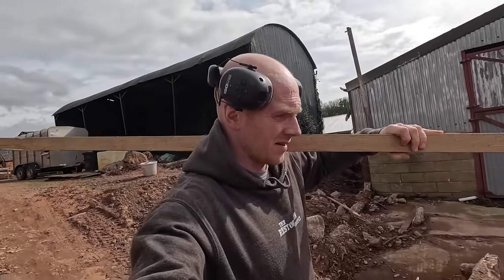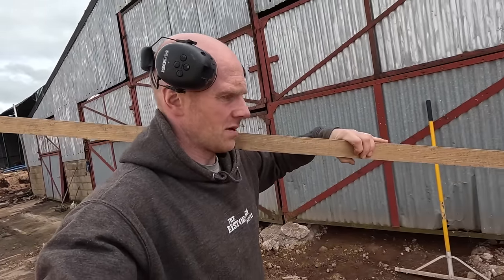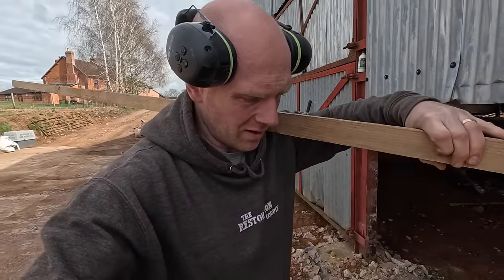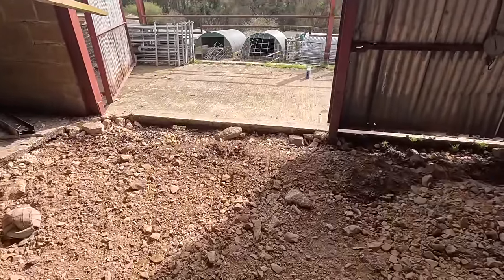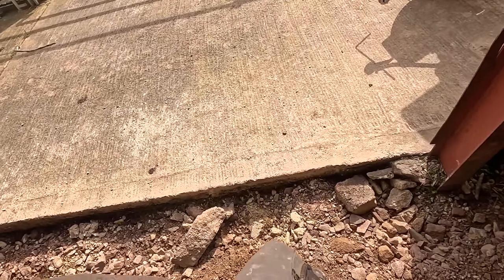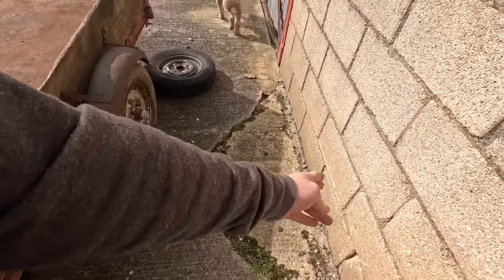The sun's out, so I'm going to go down to the far end and see if we can cut the same as we did up here — cut through the slab so we can break out ready for the edge of the new slab or the footings. This one here we've broken out up to the halfway line, but I want to do the same at the other end because I'd rather get rid of this floor saw if I can — it's just another tool sitting around getting in the way. I'm hoping this one's quite thin, but we're probably going to end up taking out quite a bit of this to decide how far the new structural slab goes. There's a crack here, so we may as well come out to the end of that.